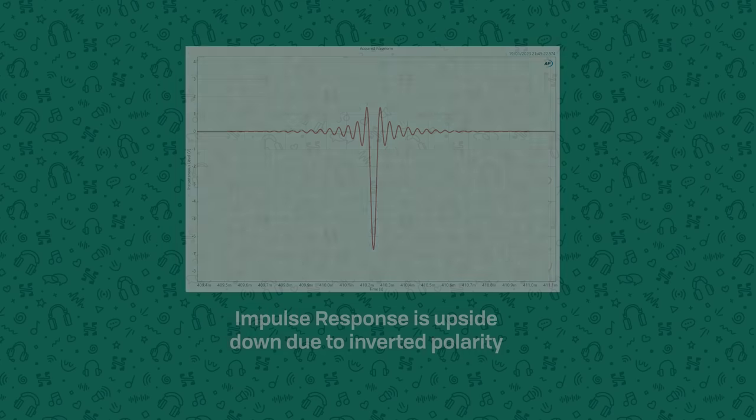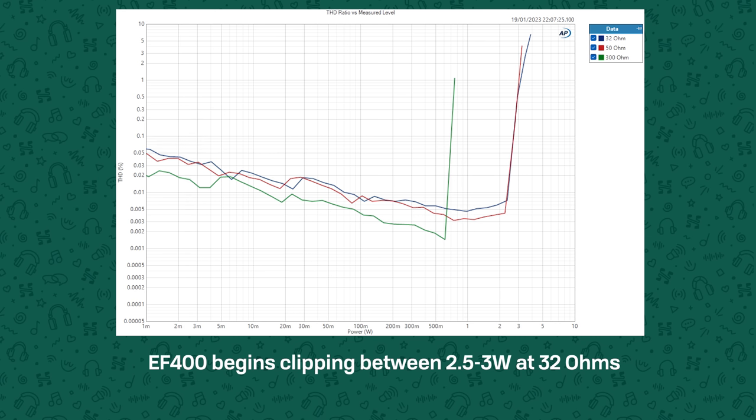If you'd like to see full measurements of the EF400 and an explanation as to why this issue is occurring from a design standpoint, go have a look at the Audio Science Review post on headphones.com. The EF400 has some problems. That phase difference really does seem to negatively impact spatial presentation. And whilst on first listen it might seem like a kind of euphonic effect, the longer I listened the more it just sounded like something was wrong. I also found other problems, ranging from minor things like the outputs being inverted polarity, to more concerning things like the output power spec of 4.4 watts at 32 ohms — in my testing I was getting closer to half that number. I've since confirmed these are design issues and not specific to this particular unit.